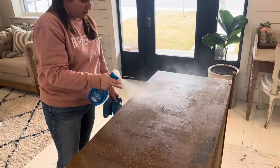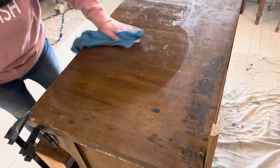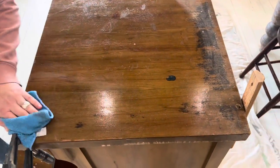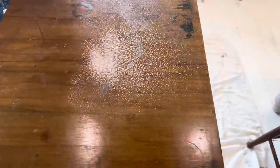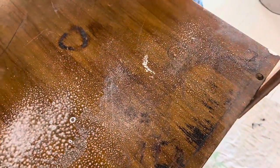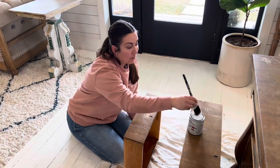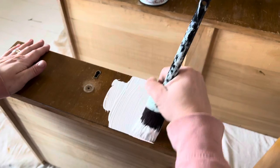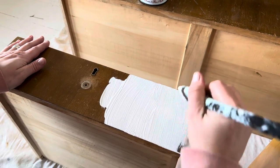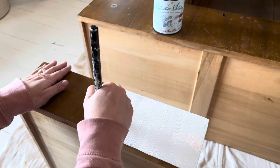See why I like to reuse this bottle? It works pretty well — we had it hanging around. This piece isn't super greasy, just mostly dusty. There are a few spots with what looks like old stain that I'll let soak for a little bit. Priming is really going to do a lot for this piece. I'm going to be using DIY Salvation Solution. The nice part about this is it is a primer, but since I'm using white, it'll also work under my decoupage paper so I won't have to use paint separately — kind of a little hack. It blocks stains and wood tannins that can come through your paper on older pieces.